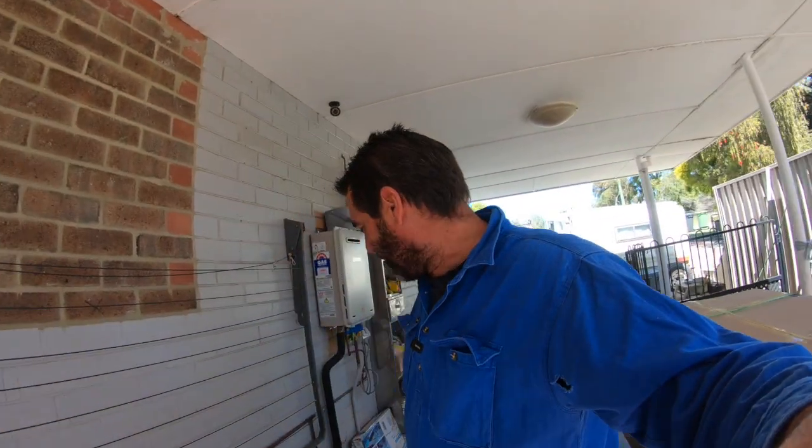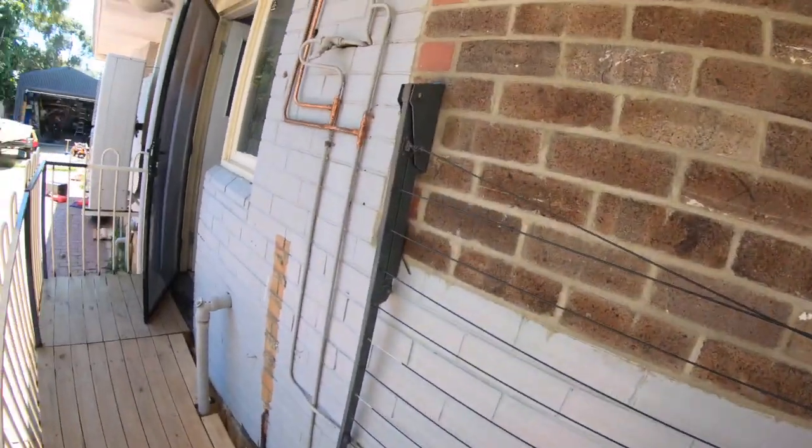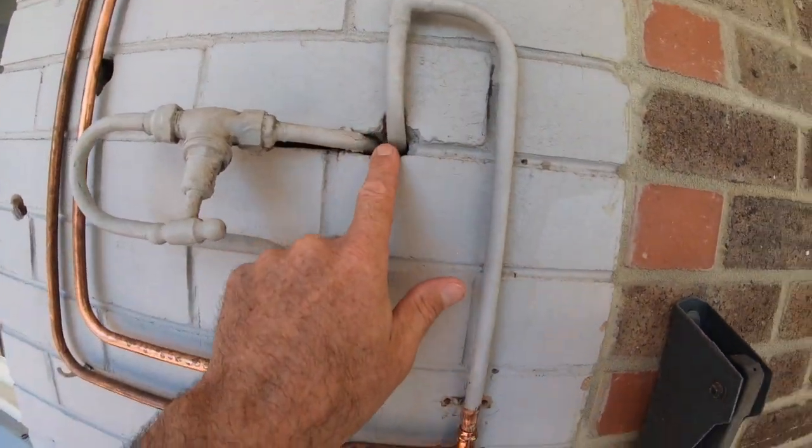G'day, I'm Ben from Beautiful Plumbing. Back in the day, back in the 70s and 80s, they were allowed to put water pipes underneath the slab — that's how they used to run it. They'd just put it under the laundry, under the bathroom and tee it all off. But what happens later on down the track, they'd have a bit of rubble laying on the hot pipe or the cold pipe, and with that expansion and contraction over the years, it would just burst and the water would pour out underneath the concrete and you'd have to knock up the floor. I came out to this job and noticed the pipes — you can see how they all go in here.